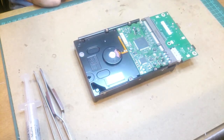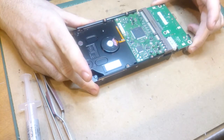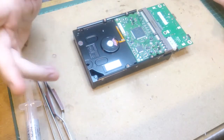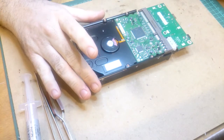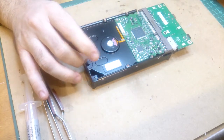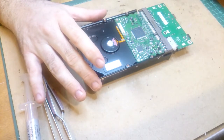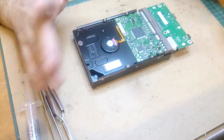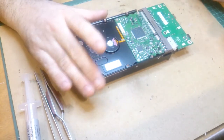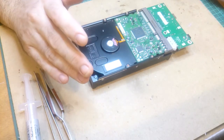What we most likely have here is a transient voltage suppressor diode that's blown through. It's a pretty common fault on these units — they can just fail for whatever reason, or maybe they've had a high voltage spike come through. It can happen if a cheap power brick has been used and excessive 12 volts has gone through. They're kind of like a fuse, except they crowbar the voltage rails rather than go open circuit.